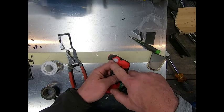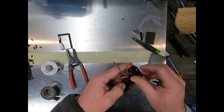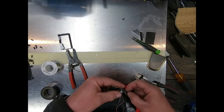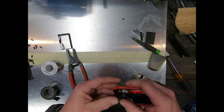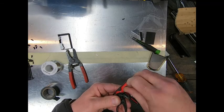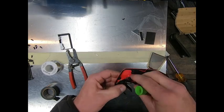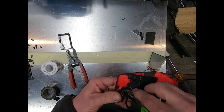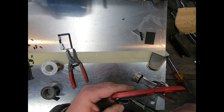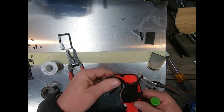They've left a really nice spot for the circuit board to drop in and a really nice spot for the potentiometer to drop in, and the wiring routes really nicely underneath. This thing fits in like a glove — just make sure there isn't any binding. Drop the wire right down here into this nice little pocket, and it's going to turn the corner right here and come right beside the battery underneath. Make sure nothing's binding up.